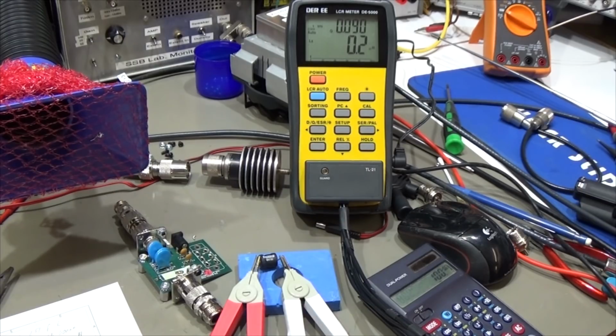Right, so the coils, the chokes, are taken out, and you see we can prove our testing result. It is 0.2 microhenry, and that is obviously a wrong pick in the factory. Maybe the person who put these parts in assumed it is 0.2 millihenry, which would then be 200 microhenry, so that would make sense. I believe this is a wrong pick in the production line. So what we need to do is put in a different part, and then verify that everything is fine and we do not have these problems any longer.